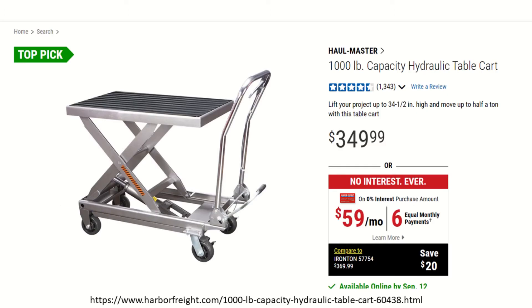4. Incorporate a front hitch receiver to allow the truck to maneuver trailers easier and install hitch accessories on the front of the vehicle. 5. To be light enough that it can be installed by one person without the need for expensive equipment. This last one was achieved by splitting the bumper into a total of five sub-components to distribute the weight, since I did not want to compromise on bumper strength or switch to a prohibitively expensive material such as aluminum.